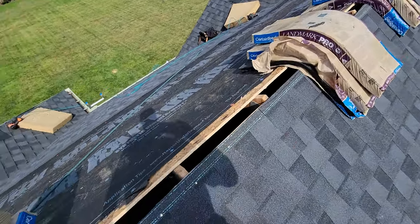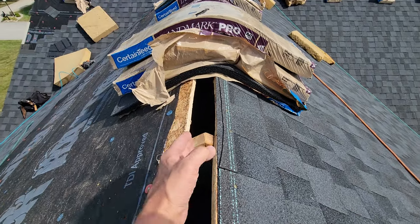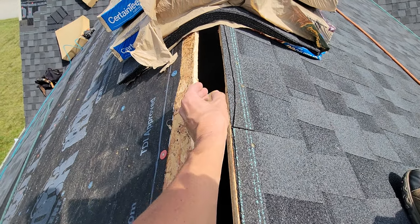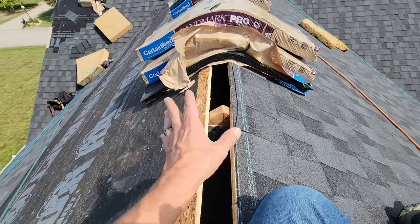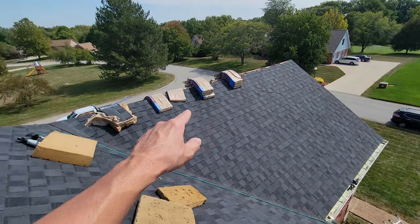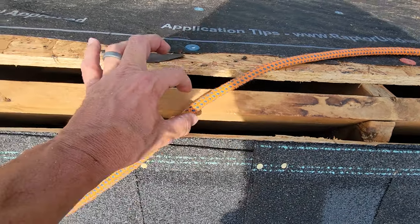If you have enough ridge space, I really prefer ridge vents. These are engineered trusses. If you have rafters, you're going to have a center ridge pole here with the rafters coming up to it — that takes up a little space, inch and a half all the way down. If you've got trusses, simply open it up. If you've got rafters, you've got to account for that — you might need to open up more. Problem is, if you open it up too much, you may not have enough solid lumber for your nails and your ridge cap to penetrate. But it's venting a whole lot more across the entire ridge evenly instead of just a box vent here. This is all cathedral area here, it's going to open up more.